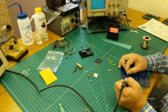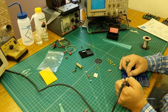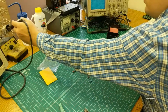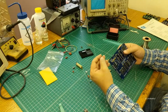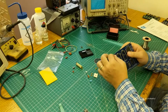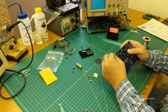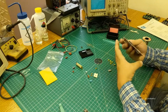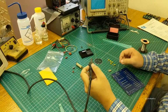And just go ahead and flip it over and solder it. And go back and touch up pin 1, since it doesn't always flow nice down through the hole. Your next item is going to be your push button reset switch, and there's 2 orientations this can go in. Either one will work. It will not go in if you have it 90 degrees out. The spacing's different, so you don't have to worry about that. And those are snap fit, so they stay put.